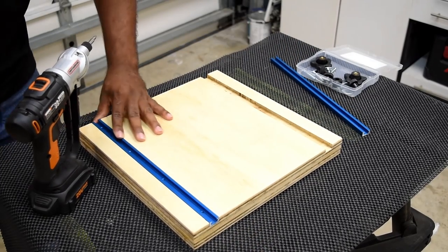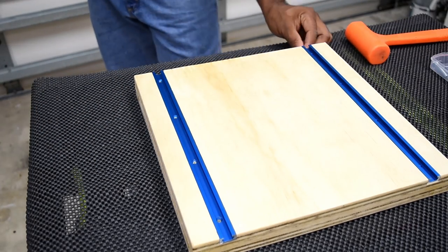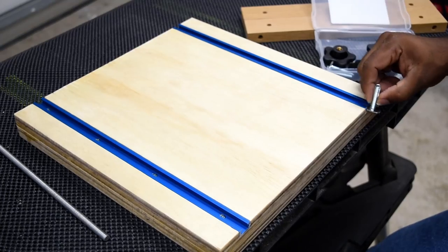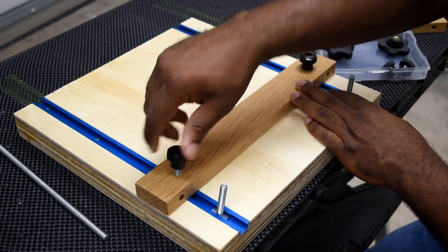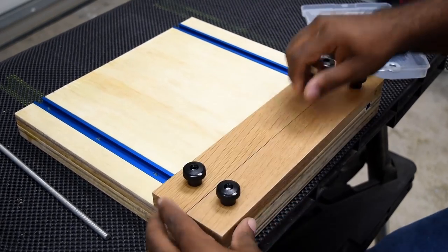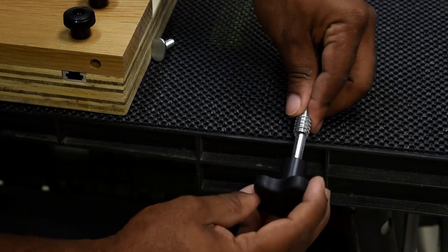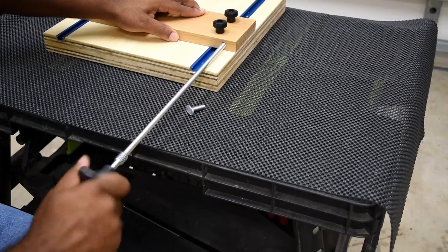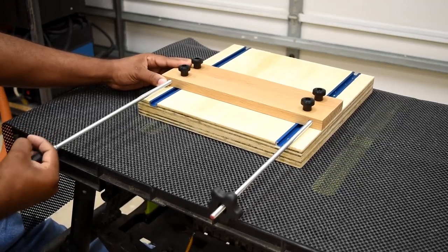At this point we can install the T-tracks. Now slide four bolts into the track and then place the back bar onto the bolts. The way to identify the back bar is the one with the holes that do not go all the way through. Now place the other bar on the two remaining bolts and tighten them down. To drive the threaded rod into the wood you can use a T-track bolt along with a threaded insert or you can use a T-nut. I do have a bolt knob which will let me get a better handle on this. You can apply a little bit of wood glue in there to help hold the bolt in place, but I'm gonna give this a shot without the wood glue. So I'm gonna take the bolt and just drive it into the wood — that's going into the one on the back side.